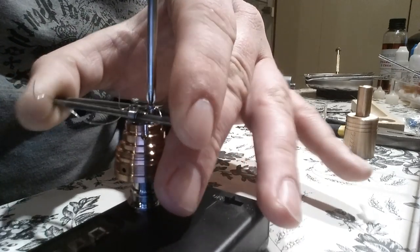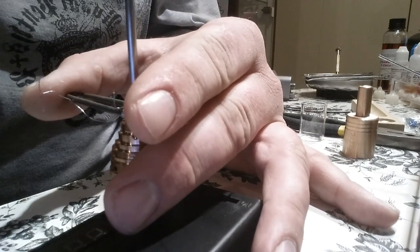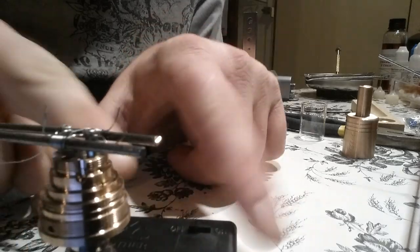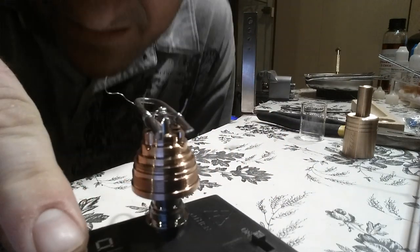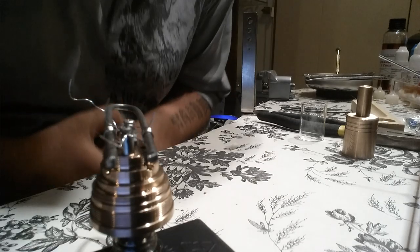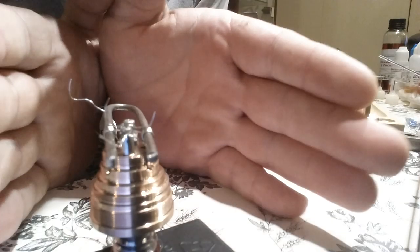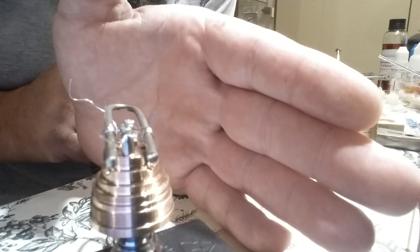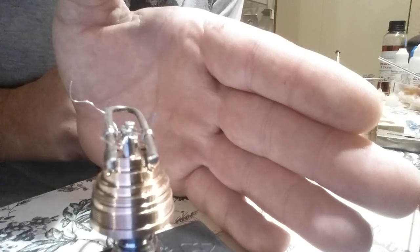Hold it with both hands when you twist so the coils don't get pulled with it. Tighten one side, then the other. You can see how the coil wants to move when you tighten it, but it stays put. Got it tightened down, sitting in one spot. So: two 8-wrap 28-gauge coils sitting on each side of the post, and the little hanger tool just holds them in place while tightening so the screw doesn't pull the coil with it.